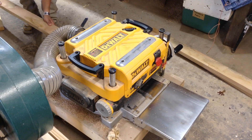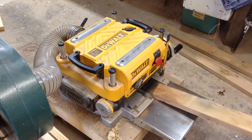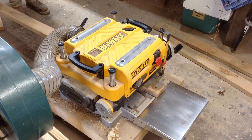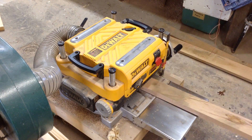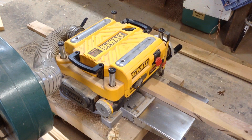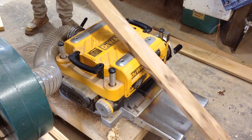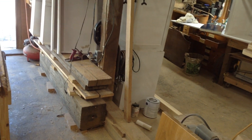The third piece was potentially going to be used for the shelves and the other two for the legs. Once I had them ripped down to size, I sent them through the planer. I don't have a jointer, so you're supposed to joint one edge flat before sending it through the planer. I have a jig that will do this, but on a piece like this where slight high or low spots on the sides won't really ruin it, I just sent them straight through.